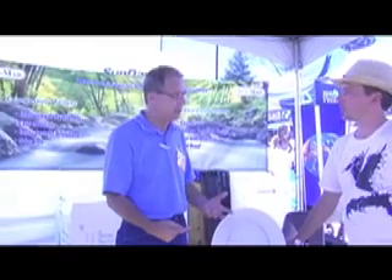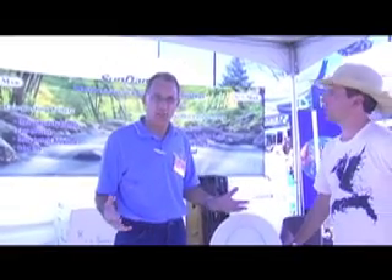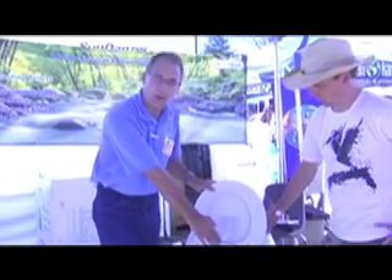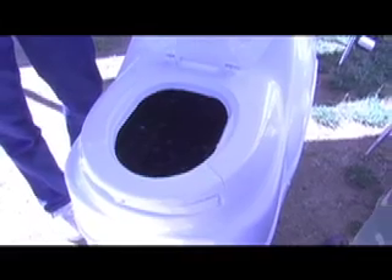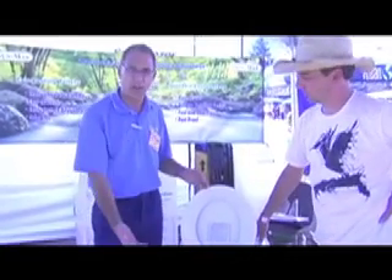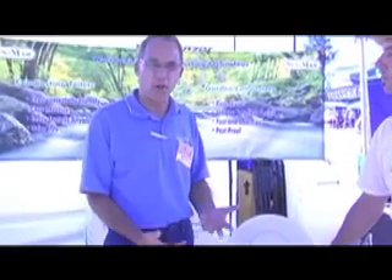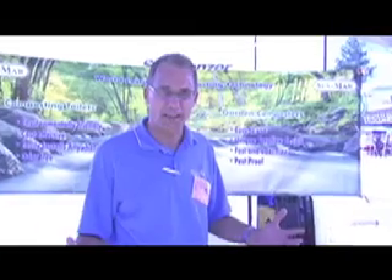In addition to mixing and aerating the pile when you turn the handle, you're also distributing the moisture throughout the pile. Composting requires 40–60% moisture. Inside this drum there is a grated opening just at the back, and excess liquids will drain through that grate to a separate area in the toilet where they'll be evaporated off. This is a non-electric toilet, and liquids will evaporate naturally. In the case of our electric models, there is a built-in heater to the floor of the unit that works on a thermostat and will evaporate 6.5 litres per day, meaning it can operate as a completely self-contained unit.